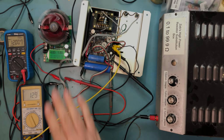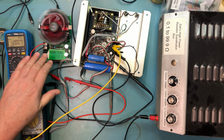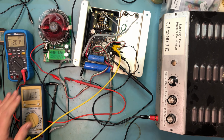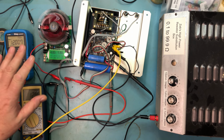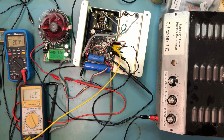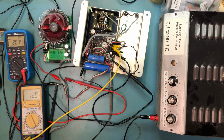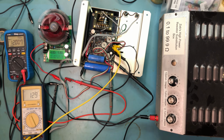So we've run the 5-volt load testing overnight, which is the constant current load here on this meter. We looked at this earlier in the video. We were drawing 1.53 amps overnight. I powered things off and back on to hook up some additional stuff. We're still seeing about a 0.17 volt drop through the wiring here, etc.